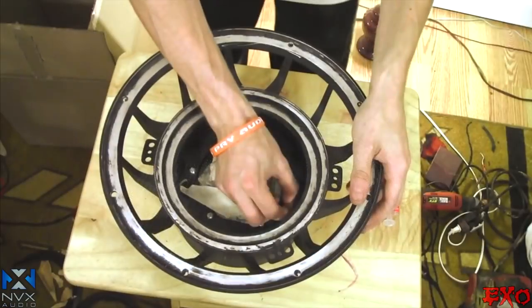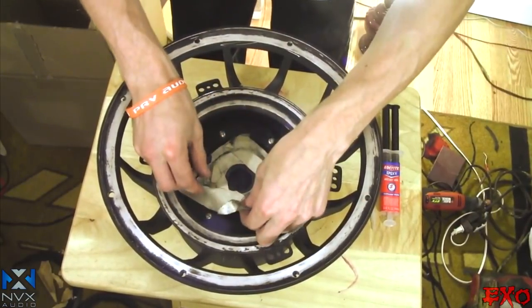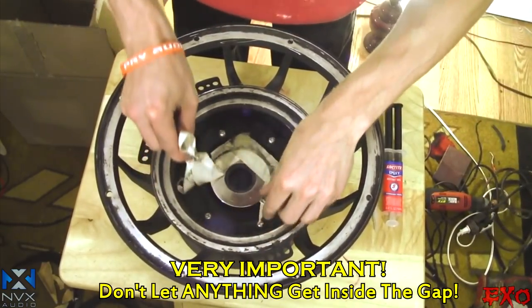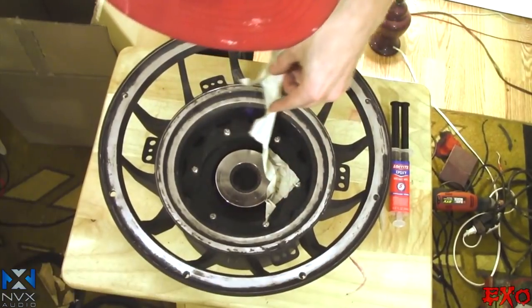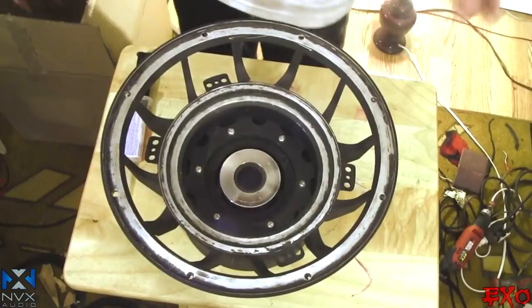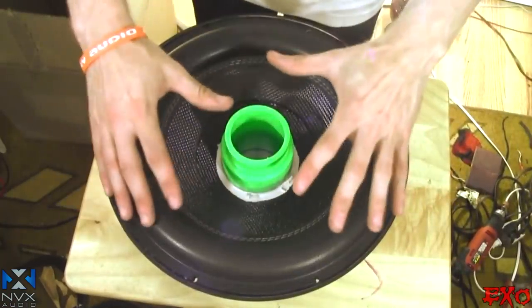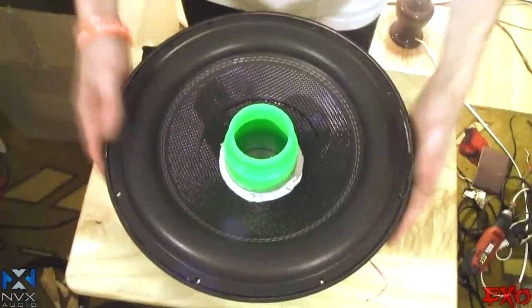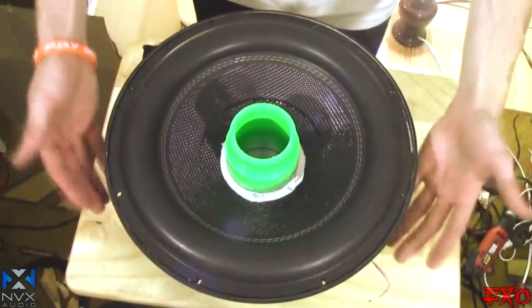Now the first step will be to remove the tape that we applied, being careful not to let any of the stuff that's stuck to the tape fall back in. Doing a pretty good job so far. There we go. We're gonna do a little test fit here, so let's take our fresh recone. So imagine if there was glue down, then we'd just go ahead and press around the sides. Some people do use hand clamps or just a regular sub gasket or maybe even some clothespins.